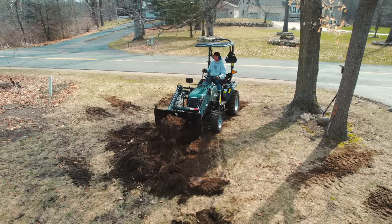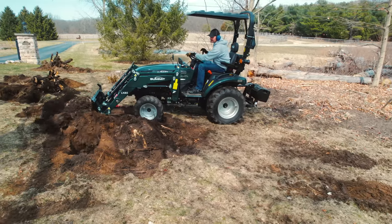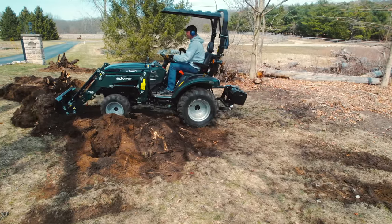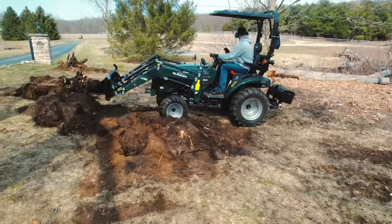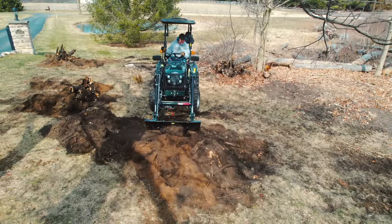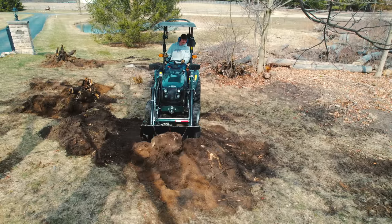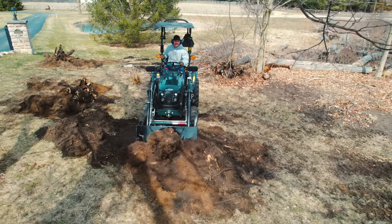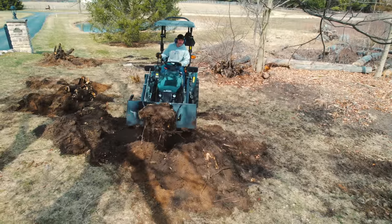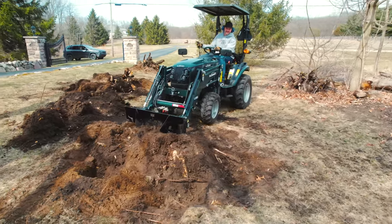Maybe you're towards the top end of the range for the Mini, bottom end of the range for the HD. So you get to that point, and I always like to sum it up and say that if you're easy on your tractor, if you're gentle on it, you'll be okay with the HD bucket. But if you tend to go crazy on things, then play it safe and go with the Mini. The reason I say that is because the longer bucket is a longer potential lever out there that can torque and twist a loader arm, okay?